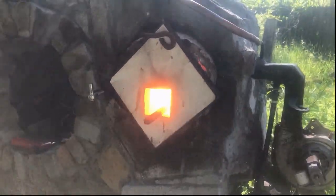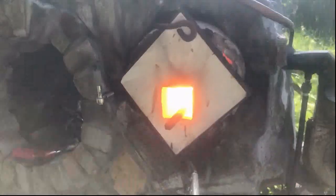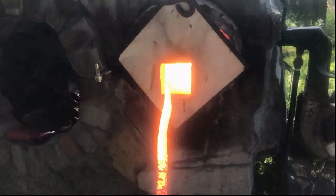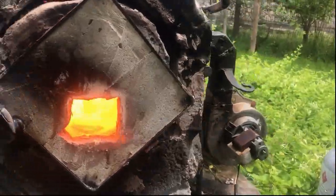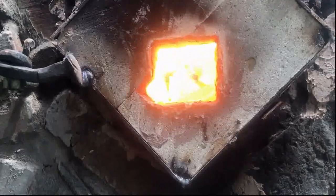It's pretty cool that I'm now able to augment my fuel with waste oil — it's going to use quite a bit less propane. I could probably even run this thing off natural gas now, which normally doesn't get hot enough to forge with. I'm putting just the tiniest whisper of propane in there and it's still staying at a high welding heat — the bar of wrought iron is starting to bubble a little bit and melt at the end. Yeah, it seems to be working pretty well. Pretty cool.